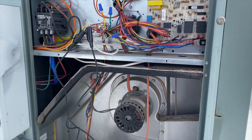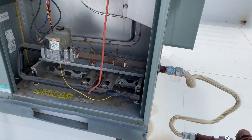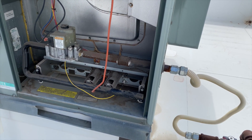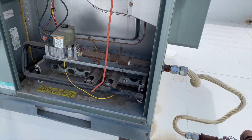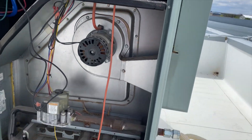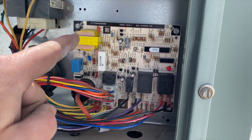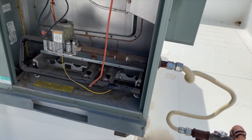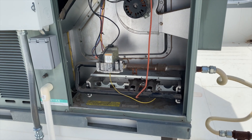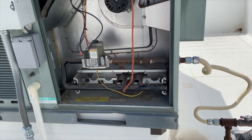Come on — spark! We have ignition! The transformer on the old board had failed, and now with the new board it's working. We're going to let it cycle through its full cycle and make sure everything checks out, but so far so good. I've already checked the blower and everything looks good. Thanks for watching — make sure you like and subscribe, comment, hit the bell notification, and follow on Instagram and Facebook.